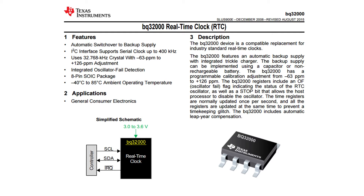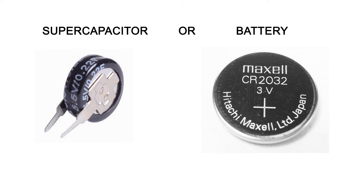I needed some way of accurately keeping track of time. A real-time clock IC could handle that job, and I had the BQ32000 from Texas Instruments in my parts bin. This is not the best RTC on the market, but I got it as a free sample and I didn't need too many features, so it should do the job just fine. There will be links to the BQ32000 and some better RTC ICs in the description. This RTC needs backup power to keep counting when main power is removed — for that you could use a supercapacitor or a backup battery. I had a 0.1F supercapacitor, but considering the rather high current consumption of the BQ32000, it would not handle the backup time for long, so instead I used a CR2032 battery.